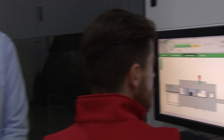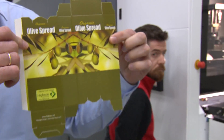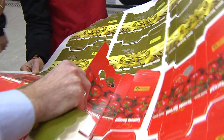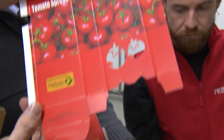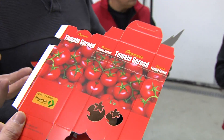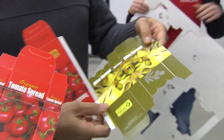So we just loaded a new job. We changed the cutting and added some decoration to it. Now we are running the same job with more cutting — taking a simple regular box and using the abilities of the laser to add an interesting cutout. We have the same job with a new cutout added in less than one minute. In die cutting terms, it's a new job. For us, it's decoration. So now cutting and creasing becomes much more than just a functional process.